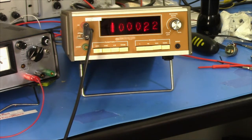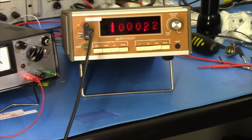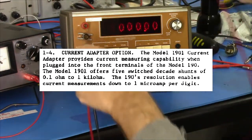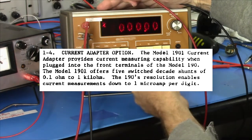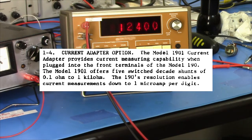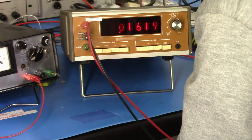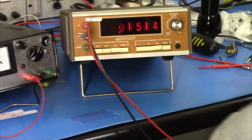And we can just quickly look at AC voltage. Notice no current measurement on this. If you wanted to measure current, you would get some current shunts and use them. Like, remember that 0.1 ohm resistor I made? No, I don't see it here. It's here somewhere. Anyway,